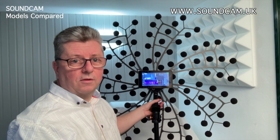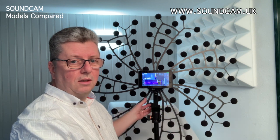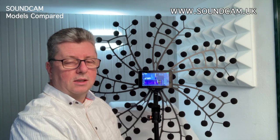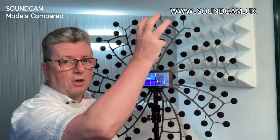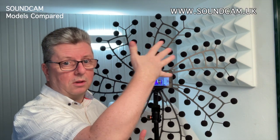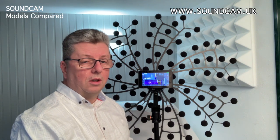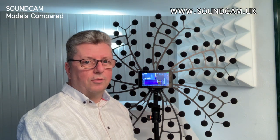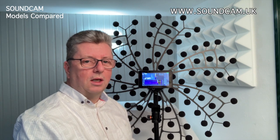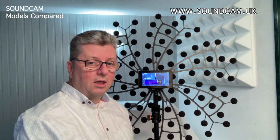It'll find sound sources. So if sound is bouncing around or it's actually traveling through the structure of something, it started at a stamping machine in the middle where the stamps come together, and it's traveled through the structure and it started to make the machine waddle about. Although you can't see it's microscopic, but the actual panels are radiating the noise. So you can see sometimes some very interesting things, which panels you might need to treat that will actually reduce the noise. I've got a good example of that on another video. So have a look at my channel and you'll see an amazing example of watching the sound travel through the structure, and gives you an idea that actually treating that structure rather than the stamping operation itself will give you the first nearly 10 dBs of sound reduction.